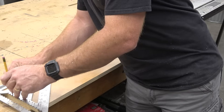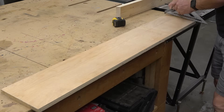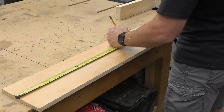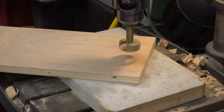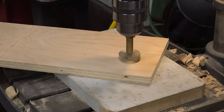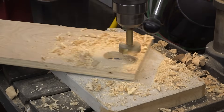I'm cutting several slots in this plywood to receive the tools and I want the end to terminate with a curve. So I'm using a Forstner bit — I'm marking a line here at 3 inches and then the other direction every 4 inches so I can use a 2-inch bit to cut those holes. I'm drilling from the top side. That's just in case there's blowout on the backside — it won't be as obvious there.